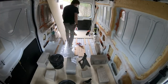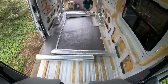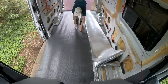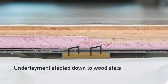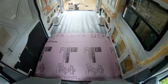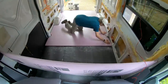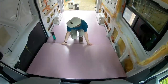I installed the strips in the middle section of the floor before the front section finished curing, so I had to get more creative finding heavy items to sit on top. On top of the strips, I added an underlayment using two strips left full width and overlapping in the center. This layer was so thin and squishy it didn't seem to matter if it was slightly thicker in the center. I stapled the underlayment down to the wood strips to hold it in place. Next, I laid the foam insulation and used some 3M high strength spray adhesive between the underlayment and the foam. The spray adhesive probably wasn't necessary — the original thinking was it would help prevent movement between the two layers which might cause squeaking, but by the time all the layers were added and secured, movement between those two layers isn't really possible.